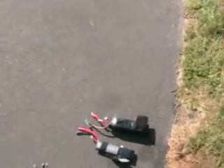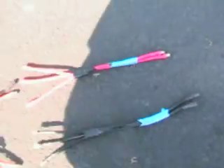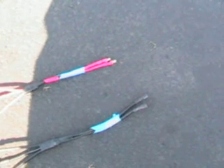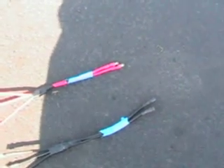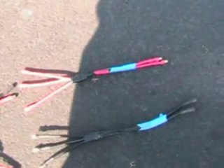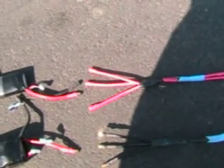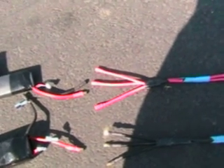The fourth flight — I've got the video up also, you can take a look at that. At the end of the flight you can see I just missed the corn. That was because when I connected the packs, the main battery pack goes right here and then connects to these two lines, then the lines go into some tubes that go back to where the speed controllers are. I hook up the speed controllers and have it set up. Unfortunately on this last flight, when I put the batteries in, one of the packs disconnected, so one-third of my power supply was not available. Instead of having 7,500 mAh per side, I only had 5,000 mAh per side for the fourth flight.